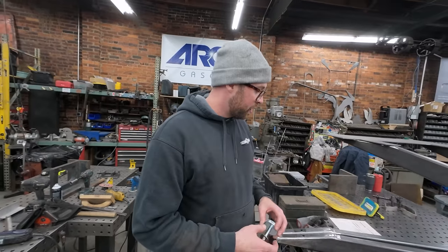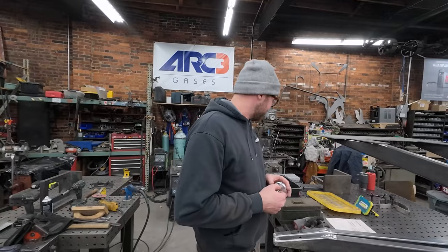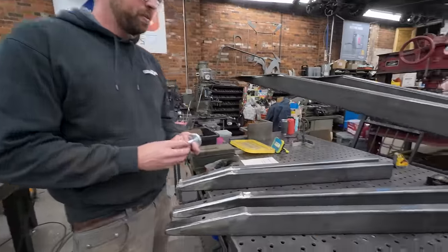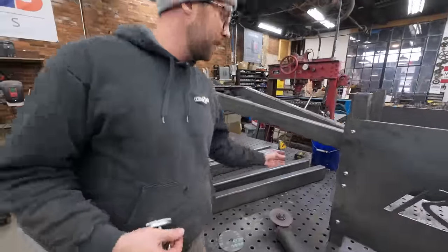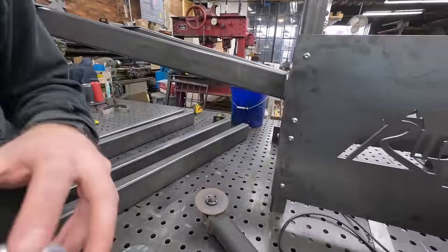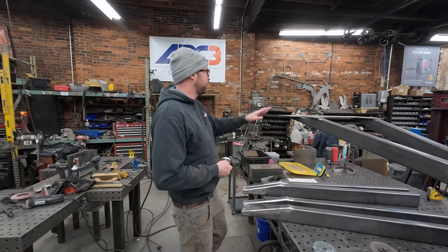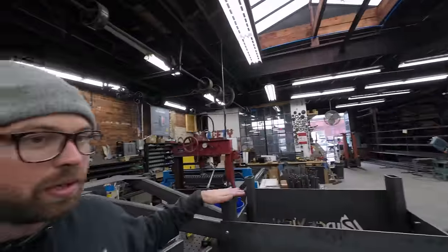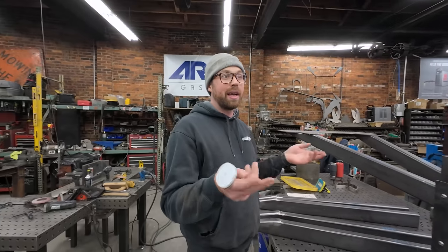So Aaron went to go run an errand, so I'm gonna prep these holes and weld these bosses in. Then we need to miter the backside of all four of these legs, and then they will mount to here. And then that's the main structure done. And then we just weld on all of our mounting plates. A plate goes here, a plate goes there on the other side, and then two long plates go here. Those all have holes in them to screw the giant wood top.